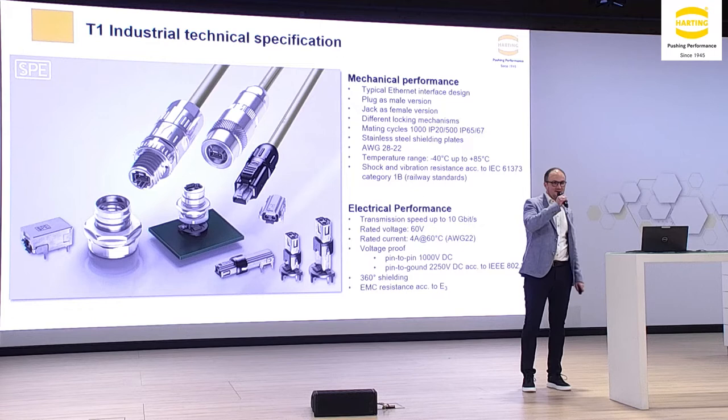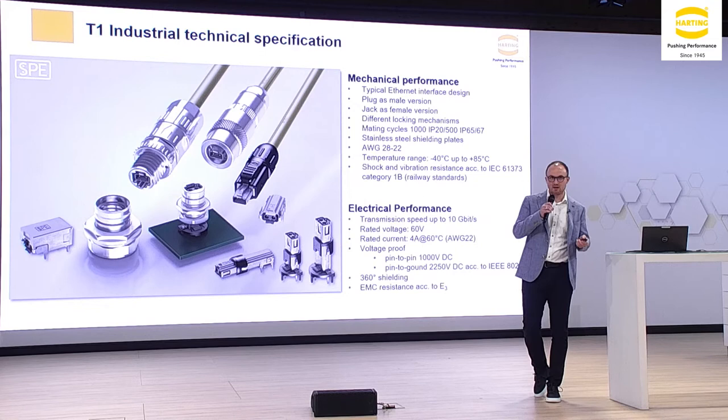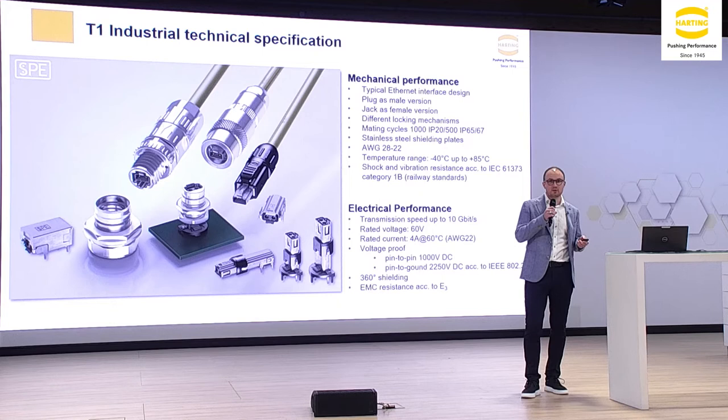All right, many thanks, Marian. So we really see that a lot of products are available today and are coming in the future. And the variants will be fully enhanced from standard connectors to hybrid connectors to different sizes. Very interesting, I found, by the way, the M12 hybrid connector for single-pair Ethernet in the future, because especially as just two data contacts are used for single-pair Ethernet, they are the perfect choice to create small-sized hybrid or one-cable solutions in the market later on.